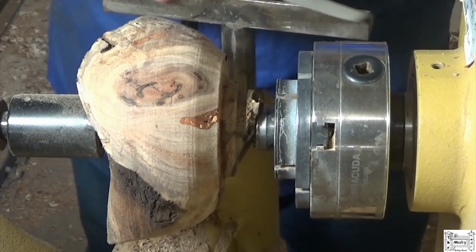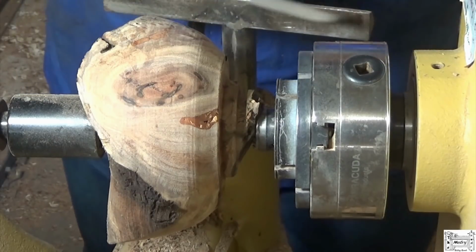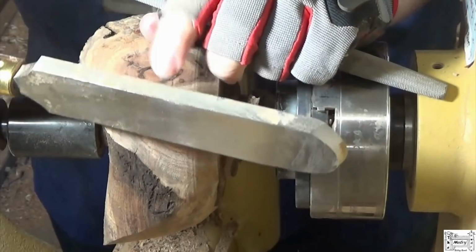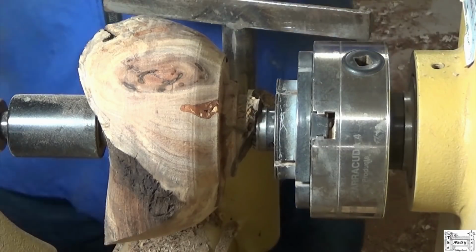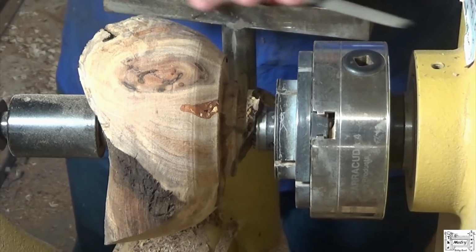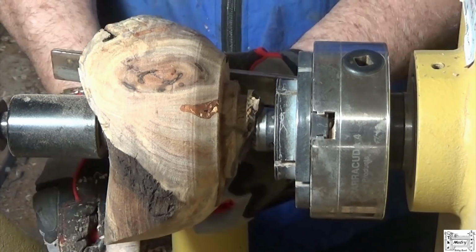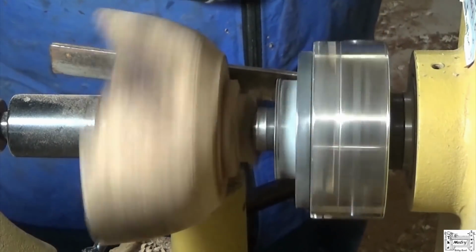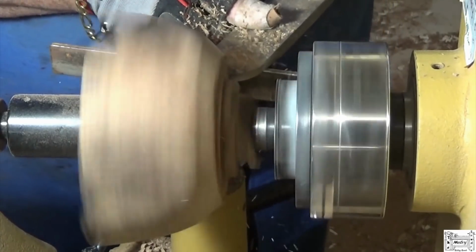One of the next things I'm going to do, if I can ever get time, is take all of my tools with a sharp edge to my belt sander and ease these edges, because it keeps making grooves. I've already done it to my skew, or skews. Because it makes nicks in my tool rest and it catches and the tool stops. If your tool stops in the middle of a cut like it just did on that scrape, it's not good. Because that leaves you with a ridge.